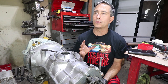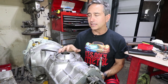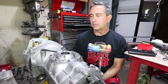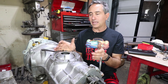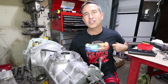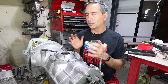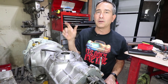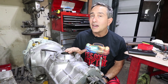If you look at the factory tool, they have a calibration procedure that's a little different — they calibrate it at 59mm instead of 59.8mm. The nominal dimension is apparently 59.8, so I don't know why they calibrate at 59 other than it being a round number. If you reference 59 and the plus 0.13 means 0.13mm closer, that gets me a little bit closer to what I have, but it's just not exact. I need to do a little more research. The earlier markings actually put the full number like 59.3 right on the gear.